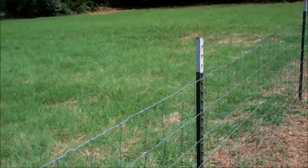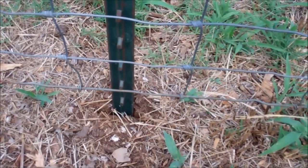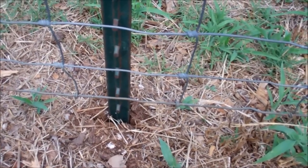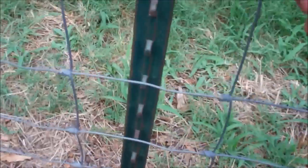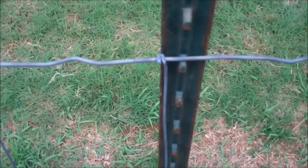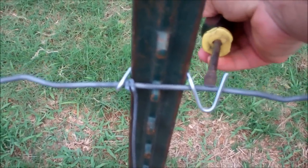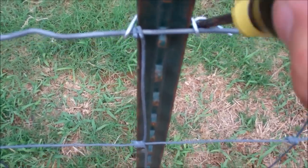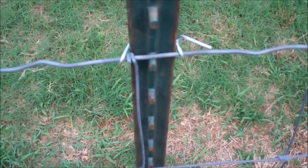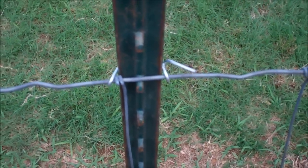Let me set up the camera for a tie and I'll show you how to tie the fence to the T-post. How to tie your fence wire to a T-post — whether it be barbed wire, in this case woven wire field fencing. Put it there, reach underneath, twist it — done. The hardest part, the most time-consuming part, is getting them out of that jumbled mess bag that they come in. That's the most time-consuming part. The rest of it is easy.